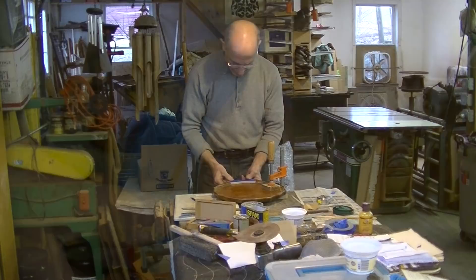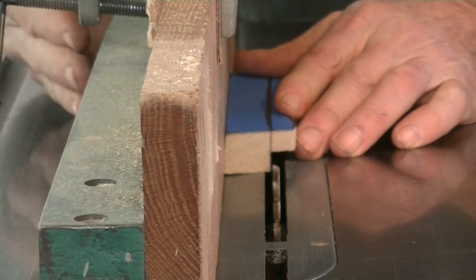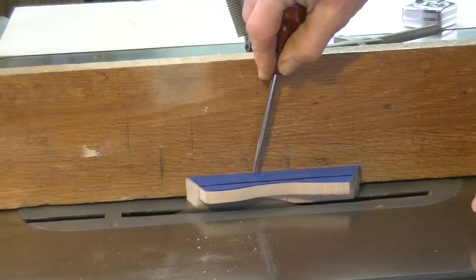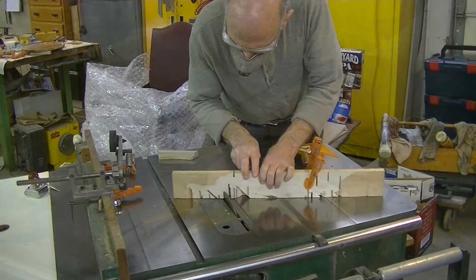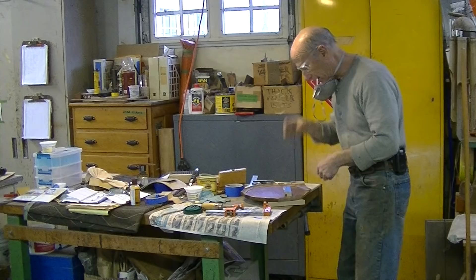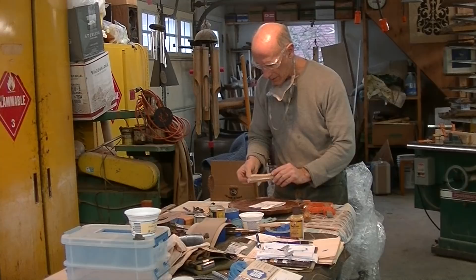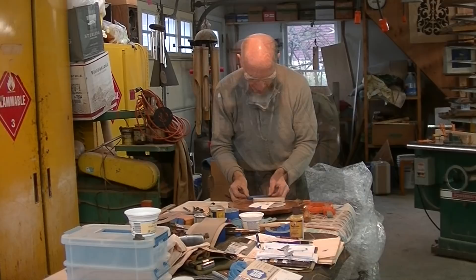I'm a little shy of my line there. Maybe I cut on the wrong side of my line or something. What I've got to do is cut back on my rabbet here, and I'll probably also have to cut a little bit off the end — just a little bit at a time until it fits. I think I lucked out. It goes right up to the line where I want it, and it's nice and flush here too. I wonder if I could use the same piece of tape to try to line it up here. Yeah, I think that'll work.